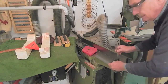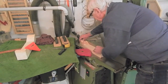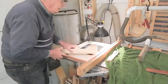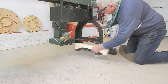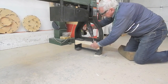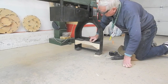Set the jointer fence at an angle equal to the angle on the underside of the web in the leg of the lathe stand. It took a couple of trips to the disc sander, but I've finally got a nice fit. The pivot block is done. I may take it out and give it a coat of paint, but for now, finished.